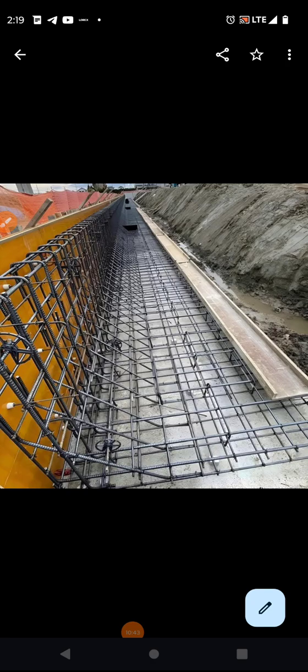You know, if it's just concrete, and then you try to just transition up, well, the concrete can just fracture itself. And then you've got to worry about expansion in it also. So it'd be a really good, nice technical key to make. You know, it's got expansion and contraction, thermal differences. So you'd have to resolve that through reinforcement, through isolation from the water, and or compensate for the water and allow the expansion to take place with the freeze thaw expansion.